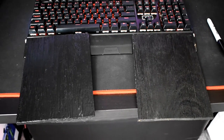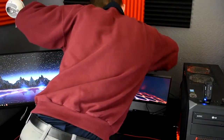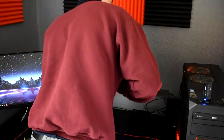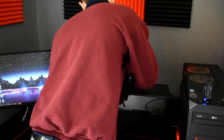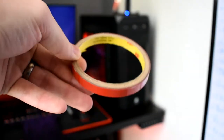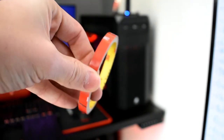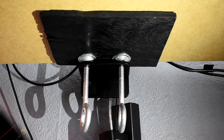Make sure you let them completely dry before continuing. Next, if you already installed your mount, take it down and remember where the clamp was, because we're going to put the two pieces of wood in the same spot. Find something to put between your desk and the wood pieces — you can roll up duct tape so it's sticky on both sides, or use some mounting foam tape. This keeps them in place while nothing is sandwiching them together and avoids marking your desk. Stick your first piece of wood on top where your mount will go, and the second piece right under it on the bottom of your desk.